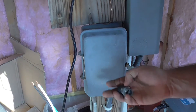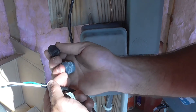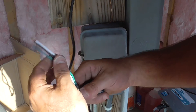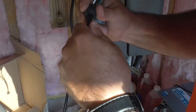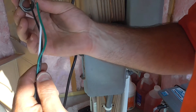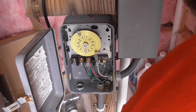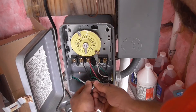Now we're going to connect the unit to the timer box. I have an outdoor grommet and we're going to use this to connect to the box. First I put on this weatherproof plug — I've got to put this end on first, slip that on, and then there's this weatherproof plug that should slip over your wire insulation. Then that comes up this way and will go on here. I got this grommet hooked up so this should come right into the box just like this, and we'll secure that to the box with the nut.